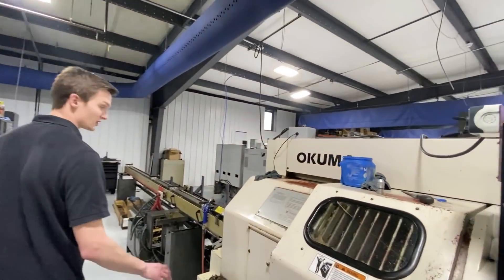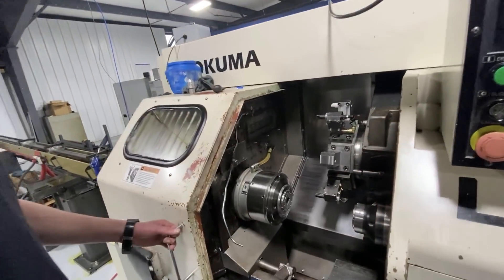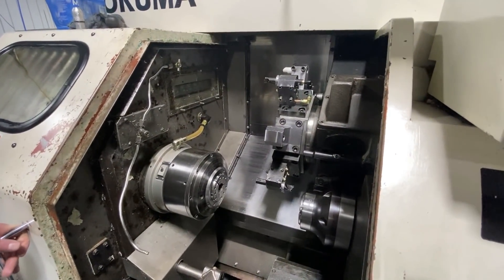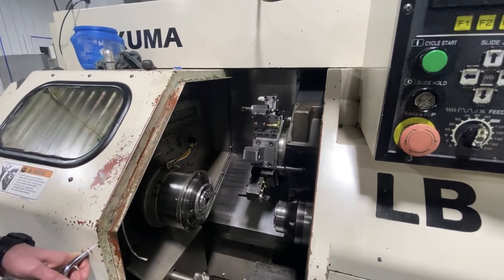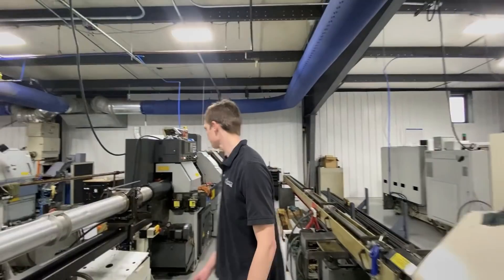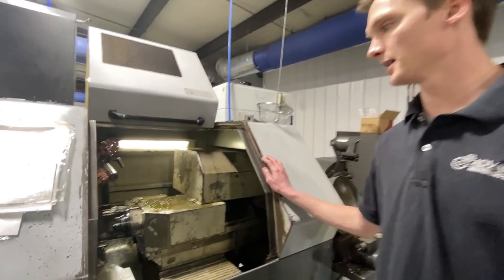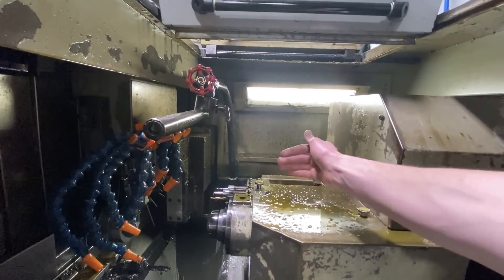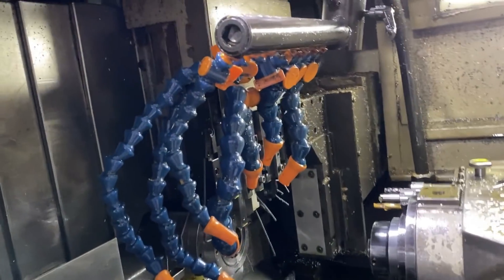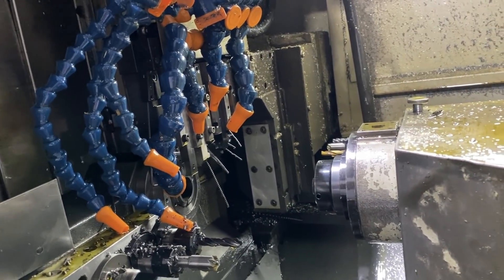Here's our other aisle. For the Swiss we've got an Okuma LB9 — a little dual spindle, nice clean machine. We love it, it makes parts all day every day. These older Okumas are just awesome. Then we have another Star SR32. This one has the sub, guide bushing, and main, with stick tools and live tools behind the cover. This particular machine runs a dedicated job — that's why the live tool cover is on. It just runs day in, day out, the same job, and it runs long parts.